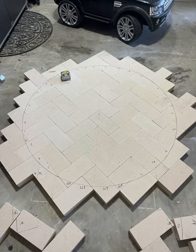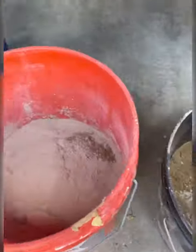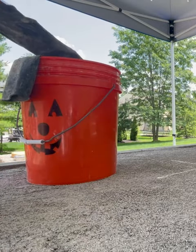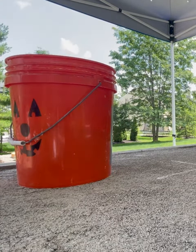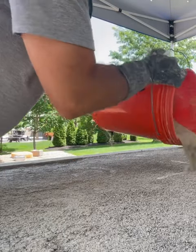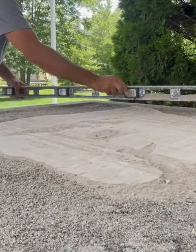You can see I sort of changed my mind a little bit about the footprint shape. Here I'm mixing sand and fire clay to use as a leveler for the fire brick floor — you should wear gloves to mix this stuff. Then just dump it out, start spreading it around, and use a straight edge to level it out.